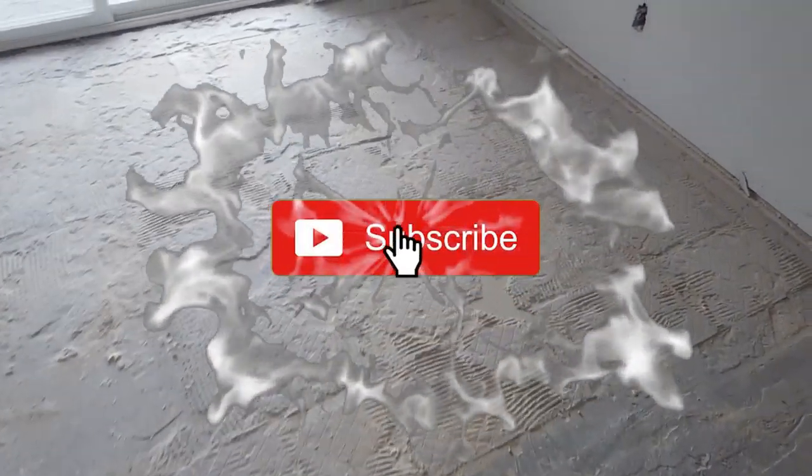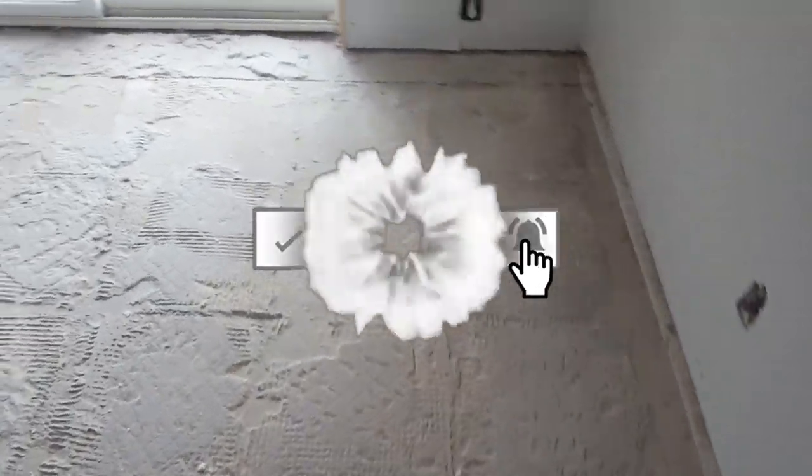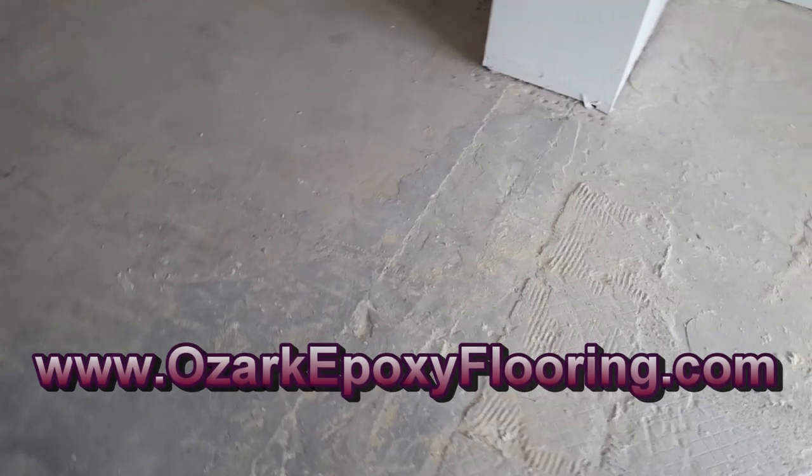I've got a foundation. I guess it was poured. I don't know how they did this, but it looks like this is the outside of the foundation and they just poured up to it. So we're going to have to throw all that in. Go in this room here. And here's where they had tiles, so we'll have to knock up all that thin set there. It's pretty thick, but we should be able to knock that down, get it all flat. And again, we've got this repair right along through here that we'll have to make and get that as level as we can.